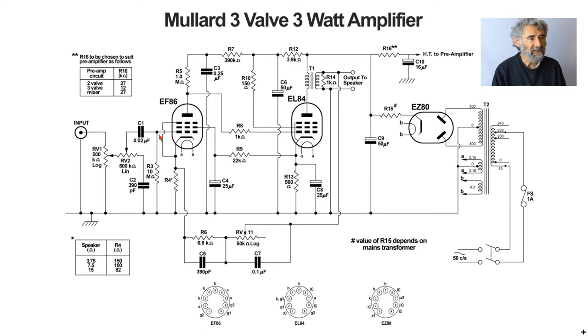There's a coupling capacitor into the grid. Unusually, given that it has cathode bias, they've used a 10 megohm resistor here. Grid bias is achieved by some electrons hitting the control grid and turning it negative — you need a high-value resistor for this to work. Unfortunately, a byproduct is increased distortion and reduced gain, so it's surprising they chose this approach. It's normally done for cheapness, to avoid needing a cathode resistor.